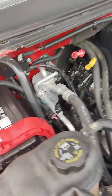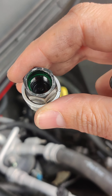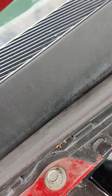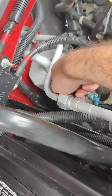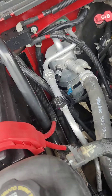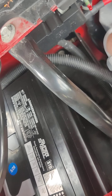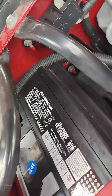Let's go ahead and change the switch and see if this will fix my problem. I got the old one off — there's pretty good residue in there. Pop this new one on. You want to make sure, because it is plastic on metal thread, that you don't put it too tight but also not too loose. I got it about as tight as I can go with my hands, now I'm just gonna get this wrench and tighten it a little bit more.